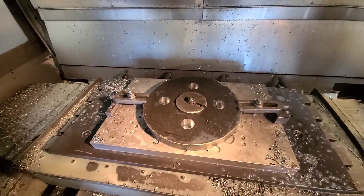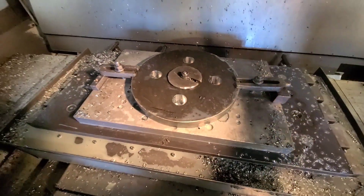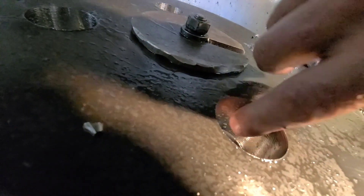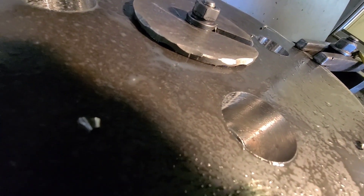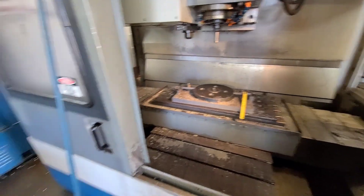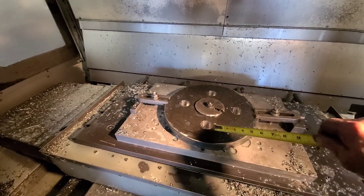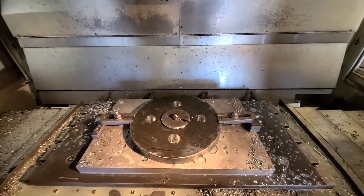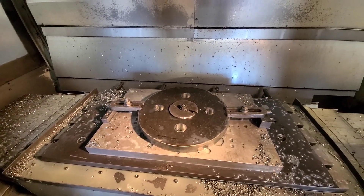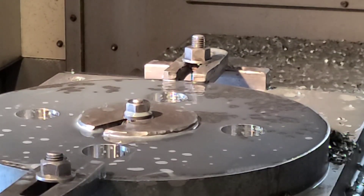Okay, we are done with the milling. At this point we want to check it — throw a little scale on there and go yep, yep, check. You can see both holes, and it's almost a drill finish but it's a spiral-milled finish. I'll grab the magnet, switch that out, do a double check. Oh, I forgot — this program has me come down with a mill cutter and 45-degree chamfer this edge here before I pull it out. So I'm gonna do that — one more tool setup, making sure there's no down offset in that tool.